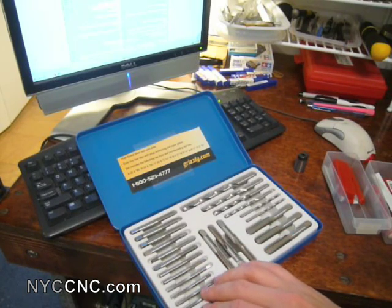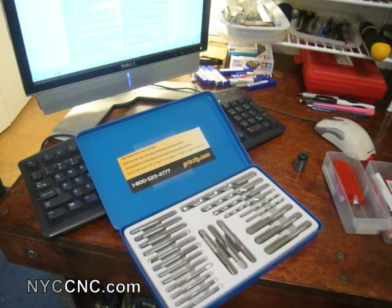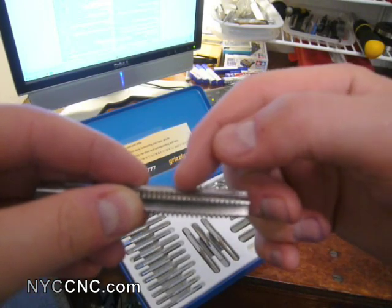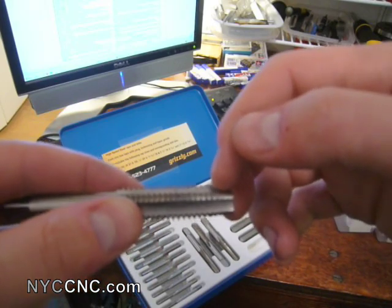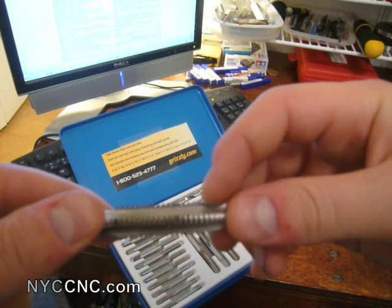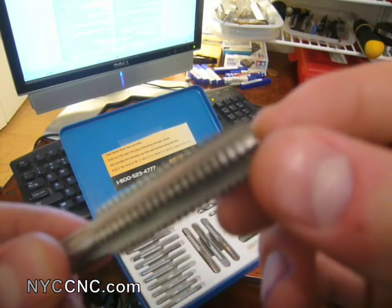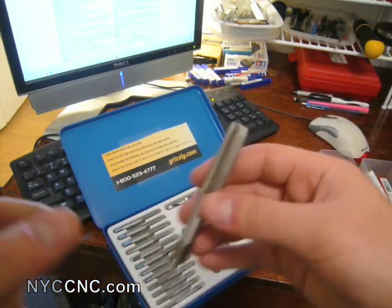The set also includes on each size TAP the three different common TAPs: a plug TAP, a taper TAP, and a bottoming TAP. What I'm holding up here is a taper TAP. What's significant about a taper TAP is the number of partial threads until you complete the full threads. This allows you to start the TAP more easily and you're taking a smaller chip load. All the cutting is done with the taper down here — with seven or eight threads tapering before it completes the full threading, it's simply a lighter chip load. That compares with the plug style, which is probably the most common, and is basically a shorter version of a taper TAP with only about four partial threads. And then the last one is a bottoming TAP.